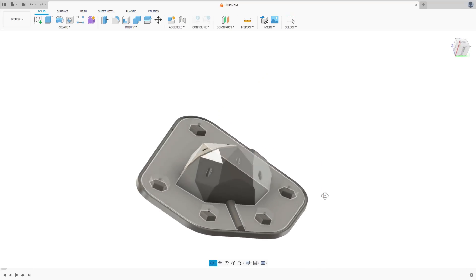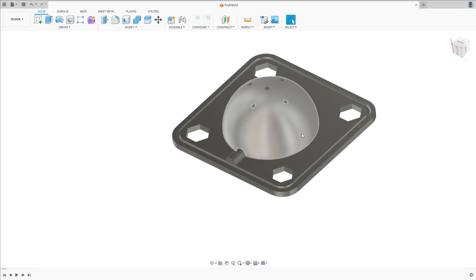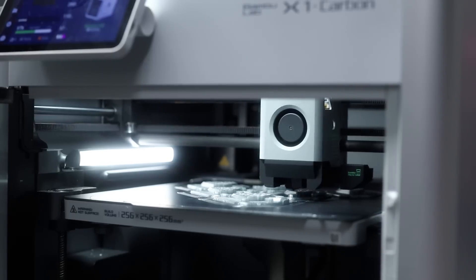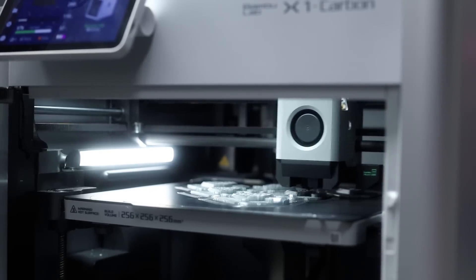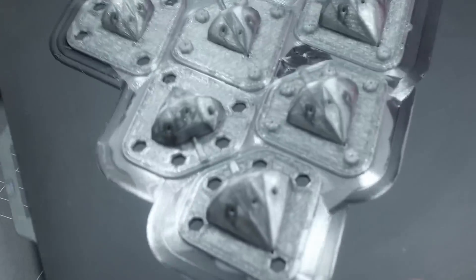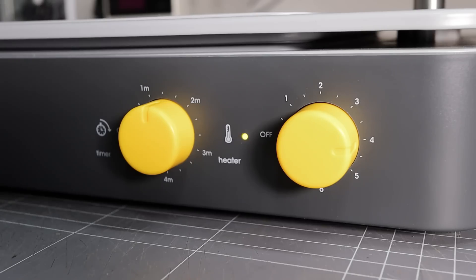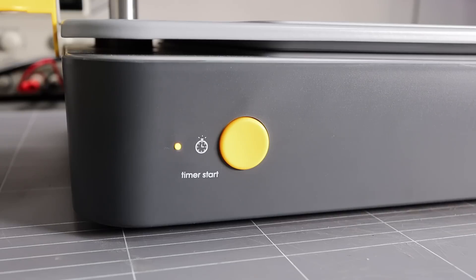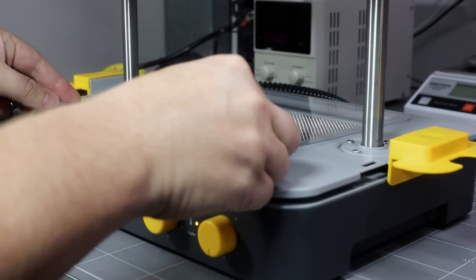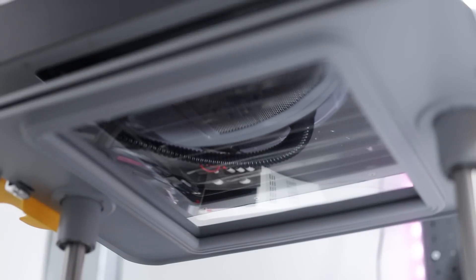With the fruit now happily growing, it was time to design the moulds. I started with a few simple designs as a proof of concept. I 3D printed these in halves using polycarbonate filament, which would hopefully provide some heat resistance when I vacuum form them to make the final product. I bought this small desktop vacuum former from Meku. It's simple to use and works well, but for reasons I'll go into later, it may not be the best option for you.